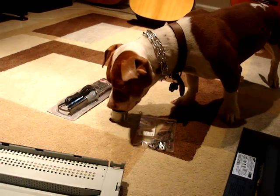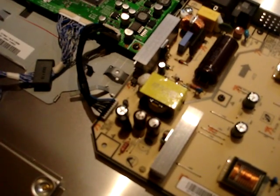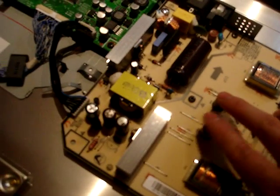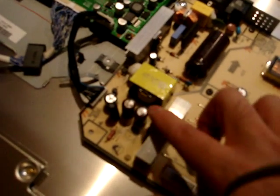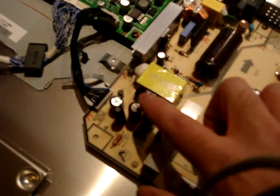This is the root of our problem. If you look down here, you'll notice that the reason why our monitor is having trouble powering on from a cold start is because we've got two capacitors that are blown. Good capacitors, like these two right here, have smooth flat tops, and bad capacitors have a bubbling on top of them. You can also notice there's some browning right here.